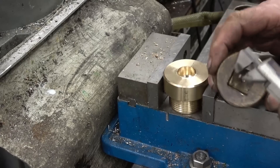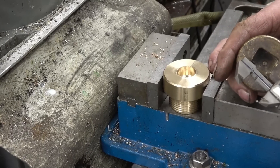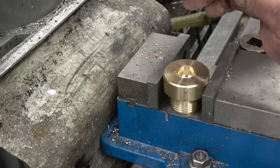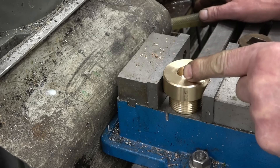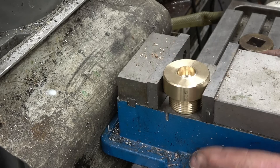Right, we've got a 20mm square hole. The milling cutter — I think it's a 5mm milling cutter. So if we take 5 from 20, that's 15. Half of 15 is 7.5. So we need to go 7.5 that way, 7.5 that way, that way and that way. We'll put the stops on to make sure that we don't go any further than that.